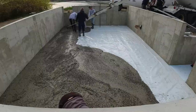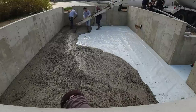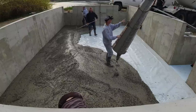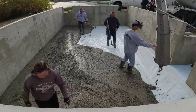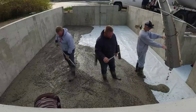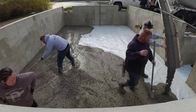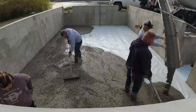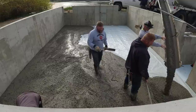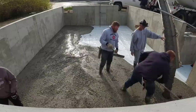We're getting the concrete poured right out. We still use our regular floor mix on this — it's a 3,500 pound mix. It actually looks kind of bony to me in the video. It looks like some of the stone is kind of separating from some of the paste. We've been having a little trouble with that this year. Some of these no-air mixes, the aggregate seems to want to just separate a little bit from the concrete paste when you pour. Concrete with a little bit of air in it doesn't seem to do that. We do pour quite a bit of concrete with air in it because we're from Maine and have a lot of freeze and thaw cycles, but some of these inside jobs we have no air. This year the no-air mixes have been kind of bony.